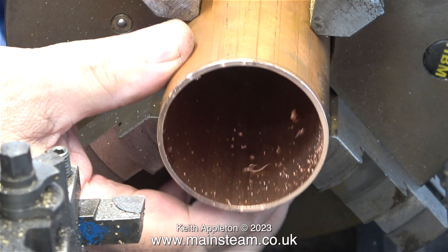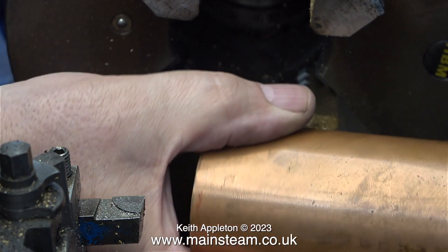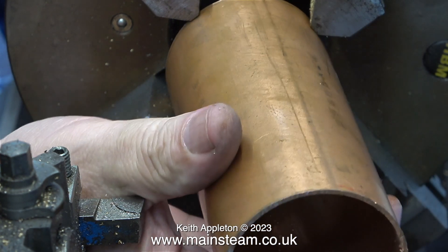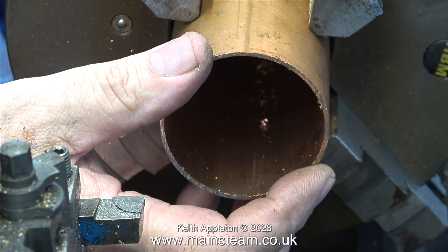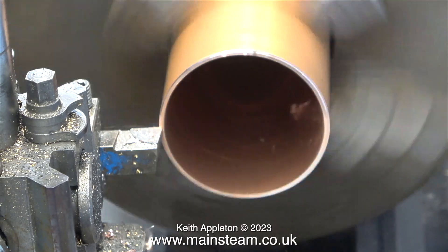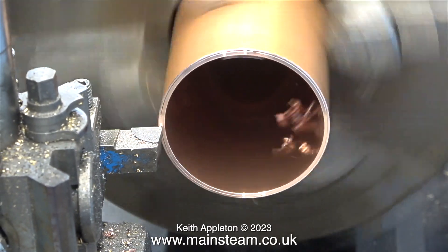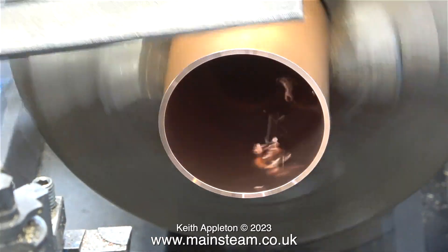I'd just like to mention that I am far from stupid, and what you're about to see I staged very carefully for the video. Notice the tool is still in position and notice how close my hand is to the sharp part. Lathes can be dangerous even when they're not rotating. Always make sure you move the cutting tool well out of the way — or better still, remove it from the holder — when your hands are going to be near it, and then refit it before the next turning operation. With modern quick-change tool posts and tool holders, this is really simple to do.